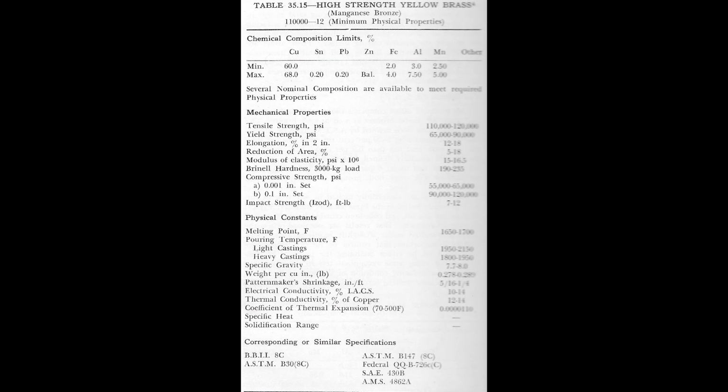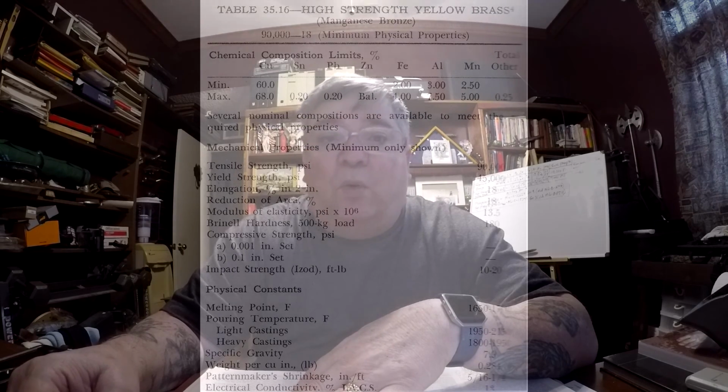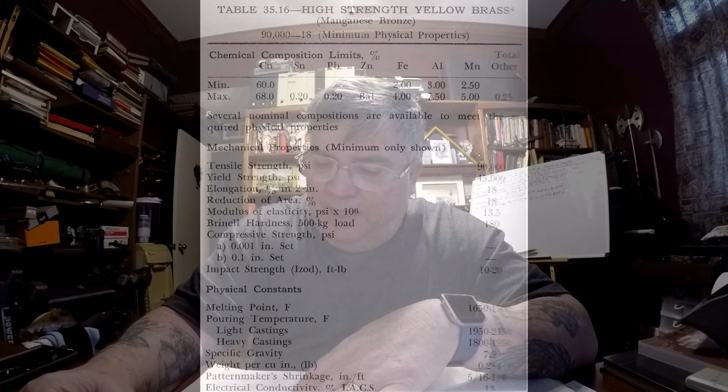Now, when they talk about excessive flare, on the Fulton, when we were heating the manganese bronze for the molds that we had on deck, which was making plaques, typically what we would do is bring it up to the temperature at which we started having a column of zinc flakes rise from the metal. It almost looked like vapors coming off of a volcano. At that time, we would shut down the furnace. We would clean the metal, scrape the inside of the crucible, and scrape off the stuff that rose to the top, and then pour the castings.